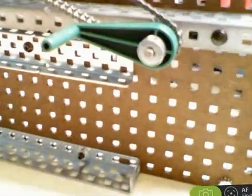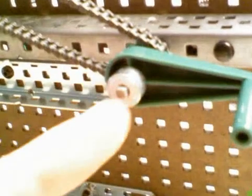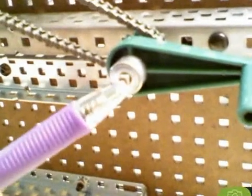I'm going to go through how to calculate the mechanical advantage of this compound machine. First, we can treat this as a wheel and axle — when this crank turns, we are turning the little tiny axle here. So our force is being applied at the handle, transferred to the outer edge of that eighth-inch diameter axle, and then that force is transmitted to this sprocket.